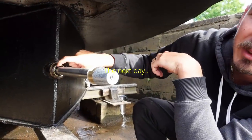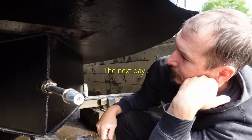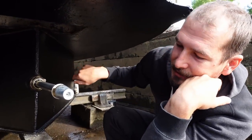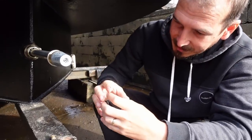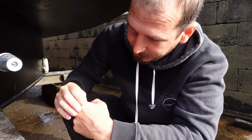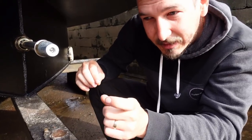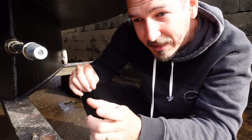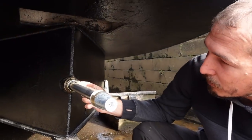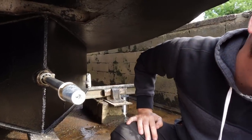I haven't put grease on it yet, because we're going to be taking it out and then I'm going to have grease all over it. So I'm pushing it in by wiggling it, essentially. Yeah, until I hit there. So what I'm going to do is push the shaft into that flange on the inside all the way, make a line and then move it like 20 mils back out, and that's how it must sit. And then I'm going to put this prop on, because I need to get the distance that the prop must sit here, and then we can cut it.